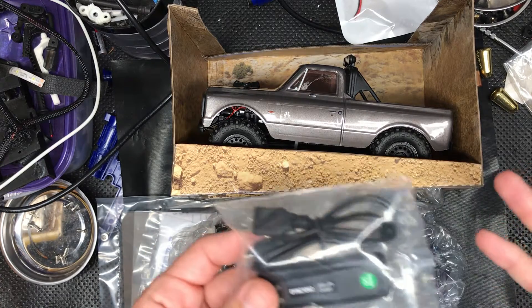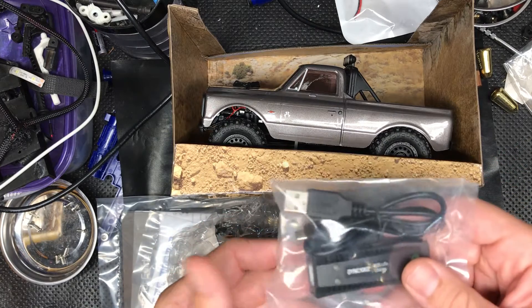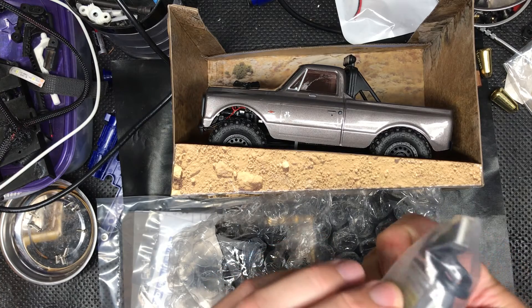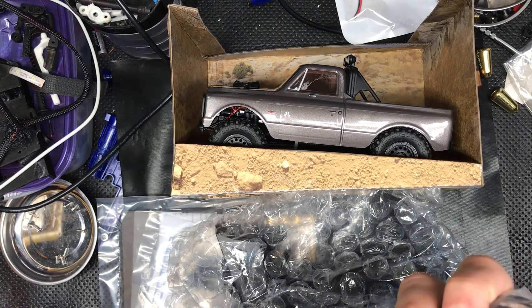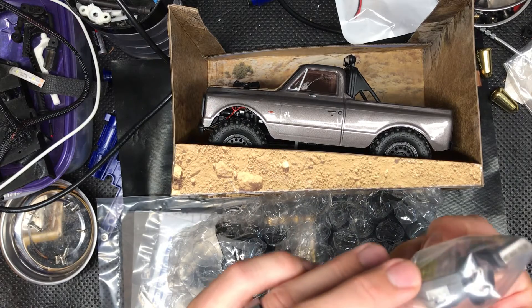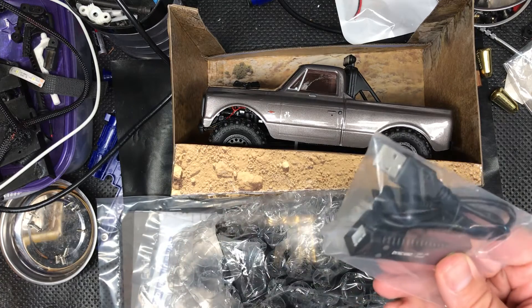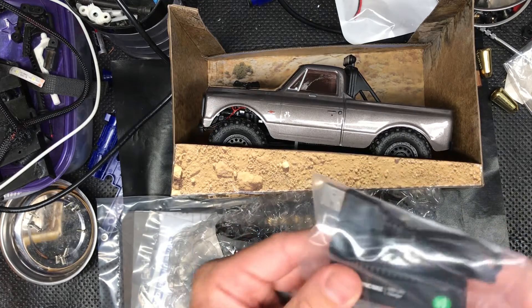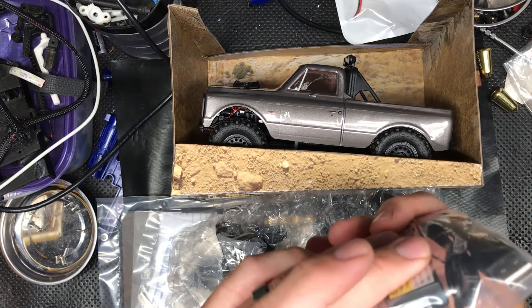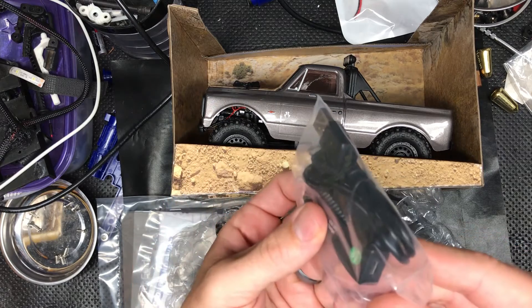I don't know why they do this. I know it's cheap, but balance charging for LiPos is key — you get a good charge and you can put it on storage charge. I thought it would come with a female JST plug so I could just cut it off and solder it, but it looks like it's built into the charger. Luckily I have some on the way from AliExpress, so I'll make my own custom charger in the future.